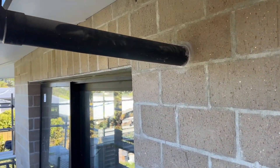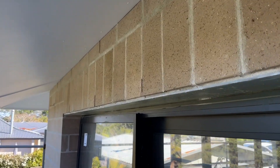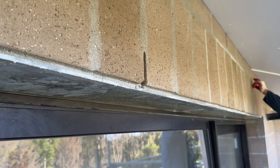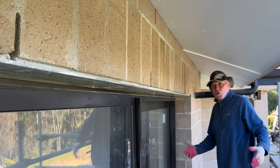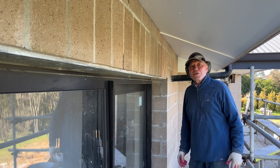There's the lintel — there's the finished product with the three little weep holes to let water out and ventilate the inside cavity, and ventilation holes at the top. Of course there's never going to be any water in there — we'd have to flood before they ever get full of water.